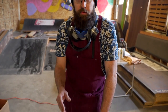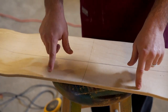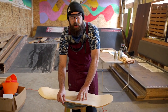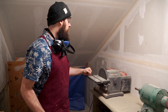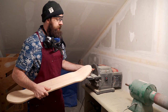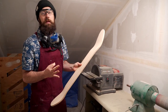We've gone ahead and done our rough cut. We can see we've left a little bit of extra material outside that line. It's a bit of a game of chicken — we don't want to ruin our shape, but if we leave too much material outside the line it's gonna create a lot more work in the sanding process. Now that we've finished our rough cut, we're coming into the sanding room and starting on our vertical sander. We're gonna slowly push our board up against the sanding wheel and control the amount of material we're shaving off, bringing everything right up to that line for a nice clean finish.